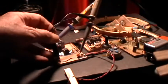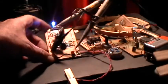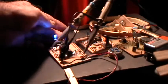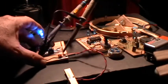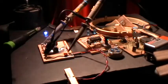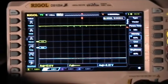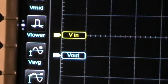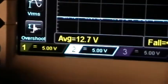You can see I have both scope probe reference clips clipped to the negative rail of the circuit. I have the yellow probe on the positive rail and the blue probe on the final output, which is negative with respect to the ground rail. So this actually inverts the voltage of the input, and we're going to look at that on the Rigol 1054Z oscilloscope. I've assigned a couple of labels — Input Vin and Vout — showing where the baselines are.